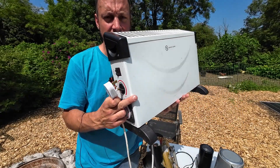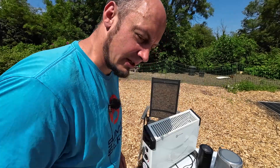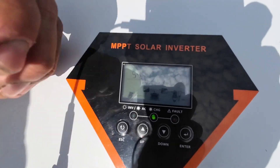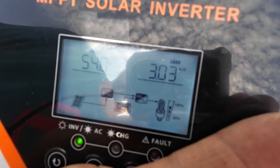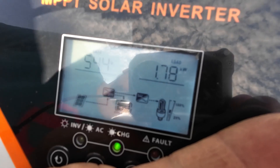Final test: we're going to run this electric heater, which is two kilowatts — probably actually uses less than the kettle. Let's see how much it uses on its own: 1.79 kilowatts. Now let me run the skill saw at the same time — and there you have it, three kilowatts. To use more than three kilowatts safely, I think I'll wire in a thicker cable.